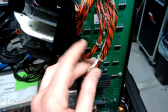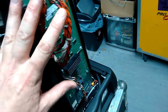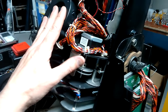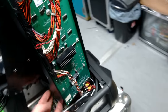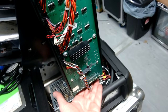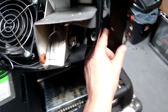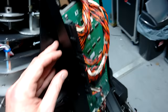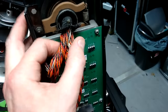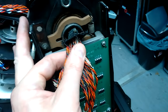This has three looms coming up. The reason the electronics are mounted in this arm is because we don't want to keep them in the head — they'd get very hot and there's not a lot of space in there. It's absolutely stuffed to the hilt with lenses and optical components. Mounting it in one of the yoke arms means we only really need data and 24 volts and various other things coming up here. Not too many connections coming through the base, because these things rotate more than 360 degrees — you don't want a big bunch of wires getting mashed about. The most stress these cables get is going through this bit here.